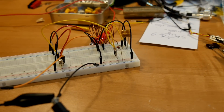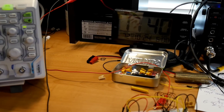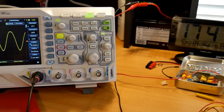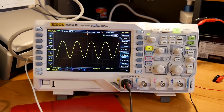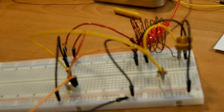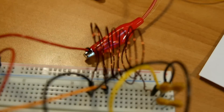I decided to breadboard the oscillator using a standard electronics breadboard. That's fine for audio frequencies, but RF oscillators need to be assembled with the parts far closer together. These long leads, even though they're only a tiny fraction of a wavelength, allowed the oscillator to produce spurious emissions in the 100 megahertz range, which were only solved by moving wires around ad infinitum.